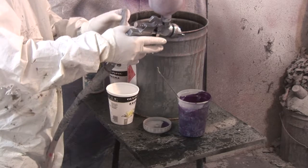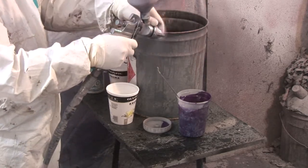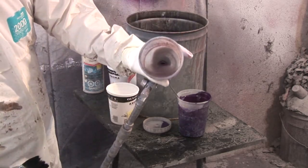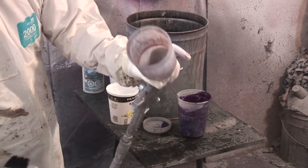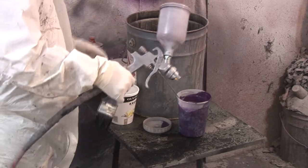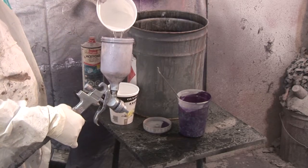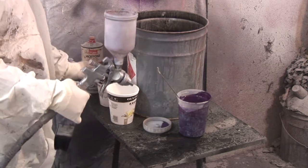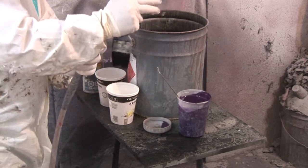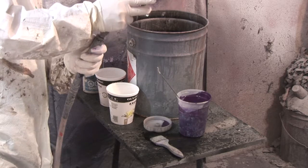Here I'm just getting all the excess overspray off the gun and threads. You can see the acetone is actually quite clean now, so I probably just need to do it once more. I'll top it up. I do store my gun with acetone in it in case there's any residue — it'll find its way down to the nozzle. When I go to use it again, I'll just run some clean acetone through it, let it dry, and then remix some gel coat and start painting again.